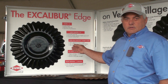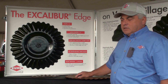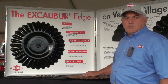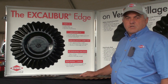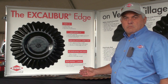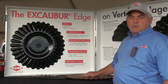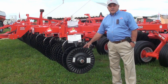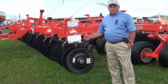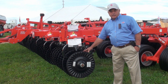You don't have to worry about sharpening an Excalibur blade. We've also discovered over time on the market that our blades are wearing exceptionally well. While these ranges vary among operators, on 30-foot machines we're obtaining anywhere from 15,000 to as high as 20,000 acres per blade. The unique design of the Excalibur blade — the shallow concavity in the flute area — combined with our minimal gang angles does not allow the tool to throw or roll the soil past the blade on the outer or rear gang.